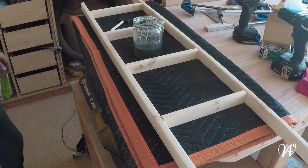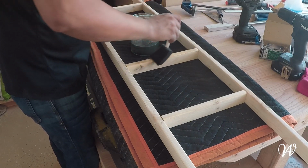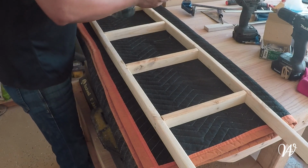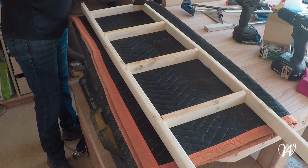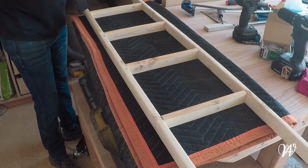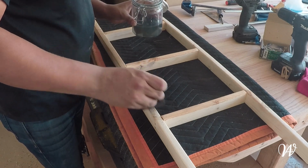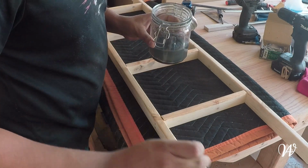And this is a really good thing to play around with if you're doing cutting boards and you don't feel like buying a wood like walnut. You can naturally turn a wood a darker color, and it is food safe. So that opens up a world of possibilities, but it does react different with every kind of wood. So I'm just brushing it on here, and then maybe I'll do a video later that has a couple different species of wood, and I'll just slap some ebonizing stuff on there, because as you can see later on in the video, this wood turned really dark brown. That was after about 2 coats, but there are some that turn like jet black. Like I think oak turns jet black.